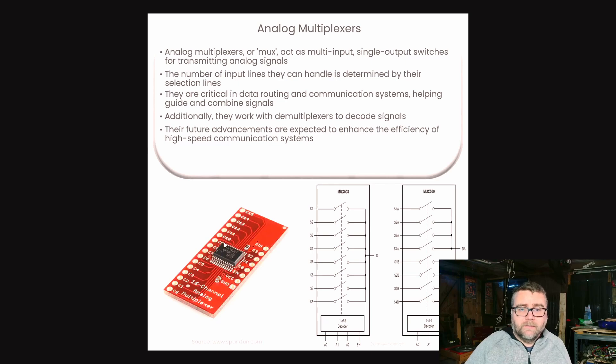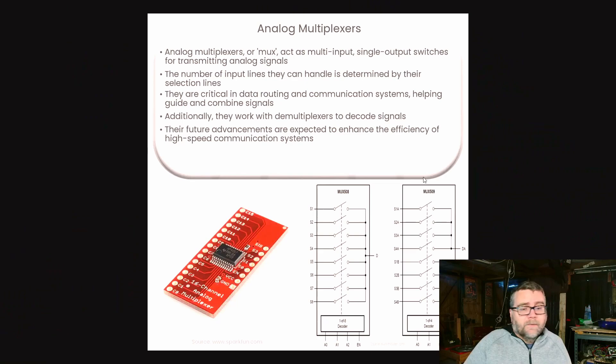So I'm going to have 16 diodes connected up. I only need five down one side and four across the top, but I need another three because of the card reading. The cards have extra holes and wherever the holes are, there's an address — so you can have multiple card layouts for different configurations. Those extra three diodes determine which card is inserted. We've still got another four spare multiplexer inputs we can use, so we can have like four rows of buttons if we wanted to. I think 20 buttons is ample.